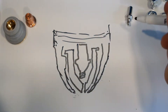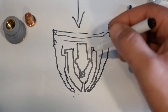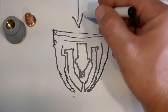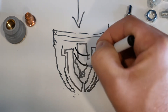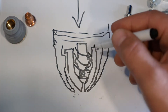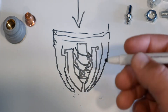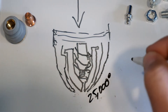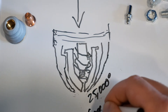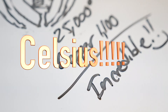I'm not an artist, so don't be making fun of me in the comments. Alright, let's go. The electrode and the nozzle are designed so as the air flows down, it becomes a swirling effect. That swirling air has a unique effect which shields these copper components from deteriorating under temperatures as high as 25,000 degrees. Let's not forget, copper melts at only 1,100 — and yeah, we're talking Celsius.